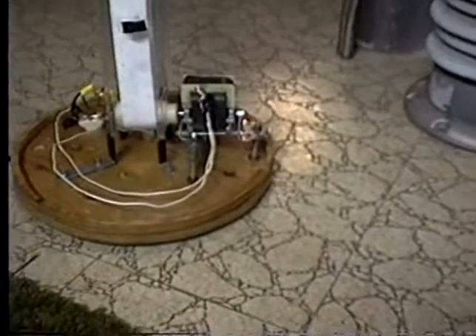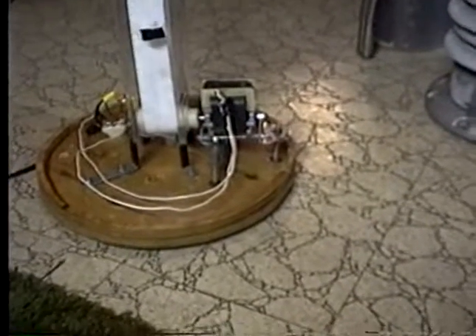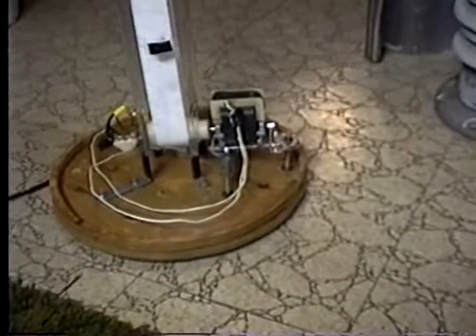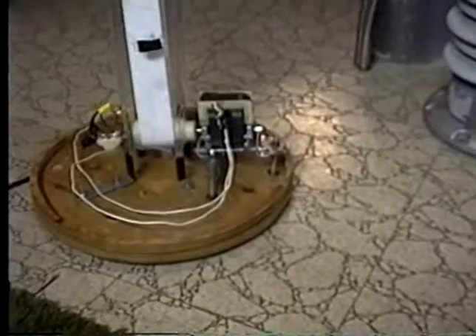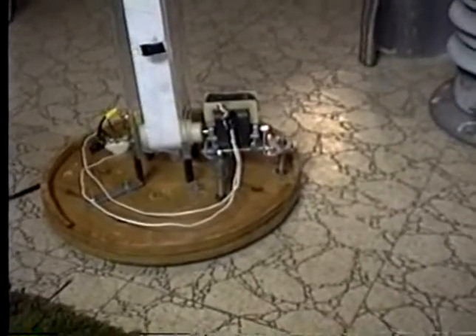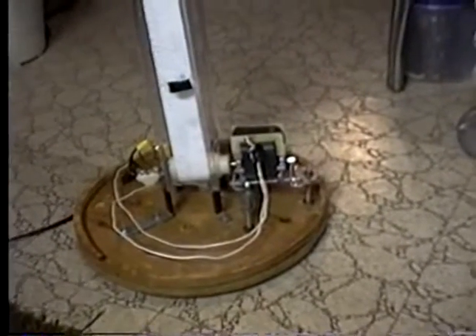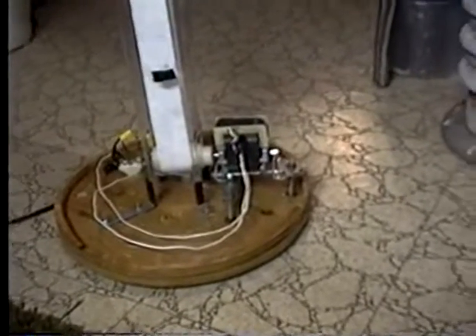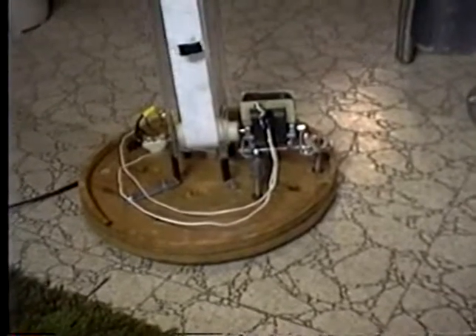The motor was a dual fan, an exhaust blower that a fellow at work had thrown out from his overhead stove. I just pressed the shaft out to get it that length — the shaft was even on both sides. The motor did get warm. We initially tried using a rubber belt, but the paper seems to be running a little cooler. In the future, we could probably get away with a stronger motor.